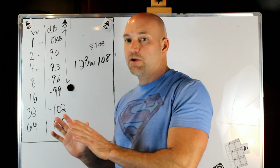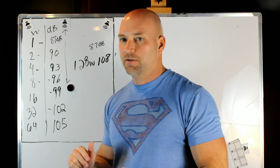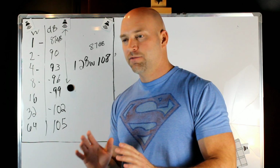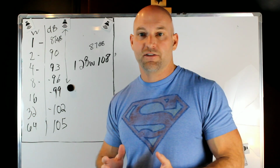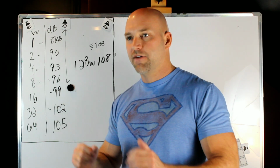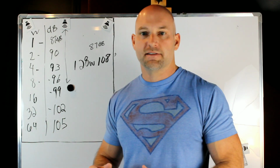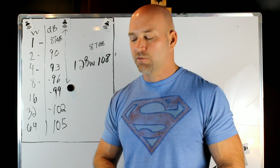And you move up to a speaker that's 99 dB, and then you're even using less power. So this is why high sensitivity speakers are in such demand. But that's only going to really help you if you're trying to listen at reference. If you're a guy like me that listens at -15 to -20, your options are more open. You may find something that to your ears has a lot more refined sound than, say, something that's high sensitivity, or if you're comparing two speakers. So you have to look at your goals and how you're going to use the room.